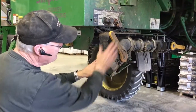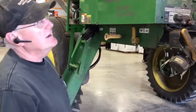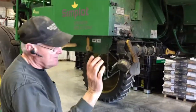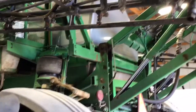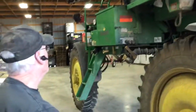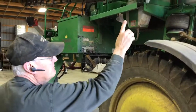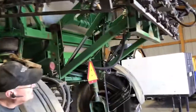When I get done, what I like to do is open this valve and drain everything that's left in the tank. Depending on what you're rinsing, if you really want to get a good rinse, you have to take all your filters off and clean them, then put in another 20 to 30 gallons of fresh water. Open all of these valves up while it's folded out and run clean water through — the water will go out through the valves, taking the course of least resistance. Then you take out all five small filters and the one big filter and clean them.